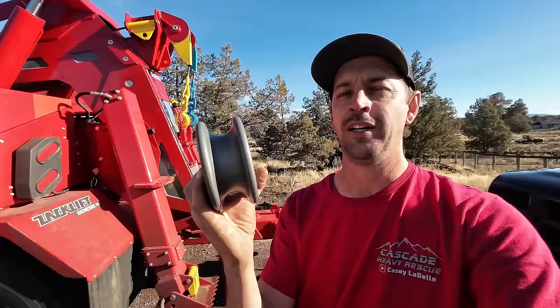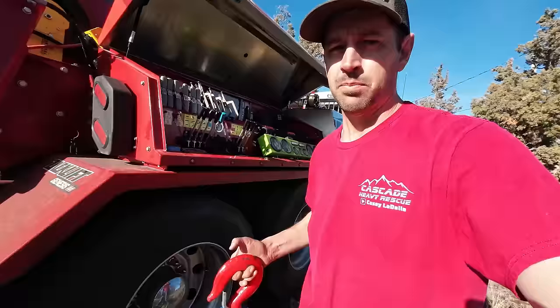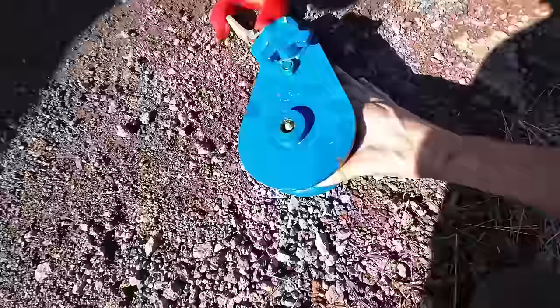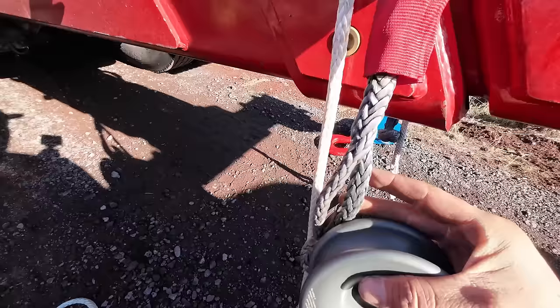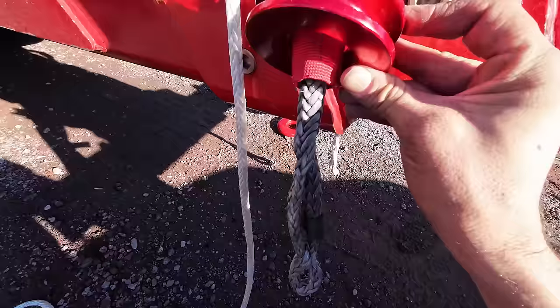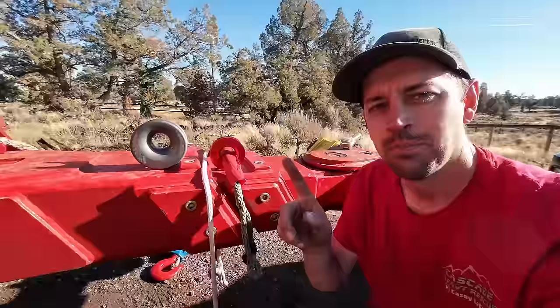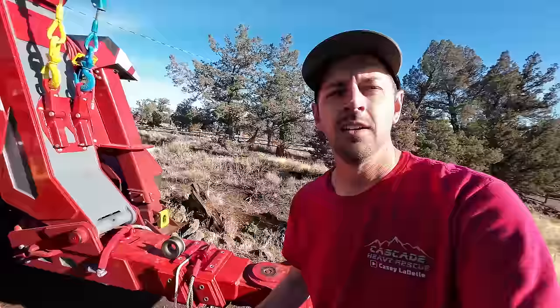Isn't that constant friction on one spot actually more of a heat buildup source — one that never goes away and just keeps accumulating? Not like the rope that only touches for a little bit and then leaves. Also keep in mind: with a traditional spinning ring, the ring spins with the rope, so there's no friction on the rope. But the friction has to go somewhere — it's on the soft shackle. And since the winch line is the same rope as the soft shackle, if friction is supposedly bad for the rope, how is it not bad for the soft shackle? Ah, but that's where the protective sleeve comes in. But is that sleeve made of the same slippery material as the winch line? Because if not, you could actually be creating more friction loss with a spinning ring on that sleeve than with the non-spinning ring and the rope sliding over it.